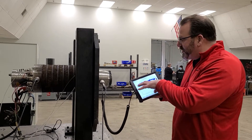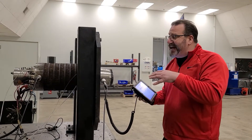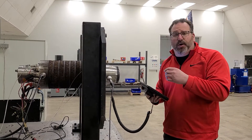So we're measuring vibration — checking velocity and acceleration on the spindle. For this customer, it's right at the top of the threshold, running close to 0.9 G's on the front of the bearings. But that's actually within OEM spec.